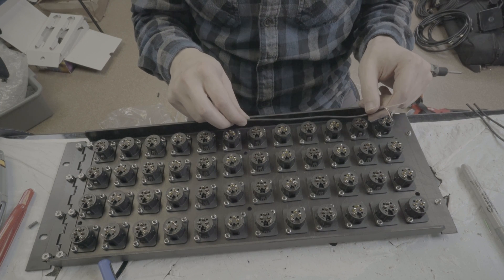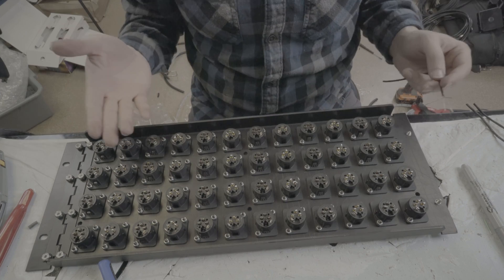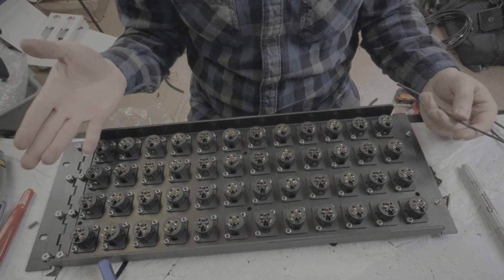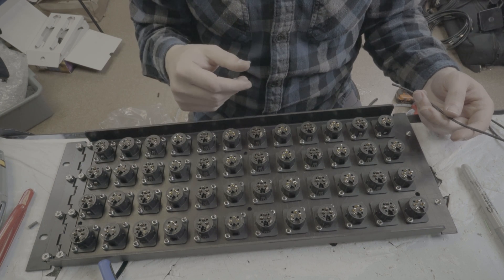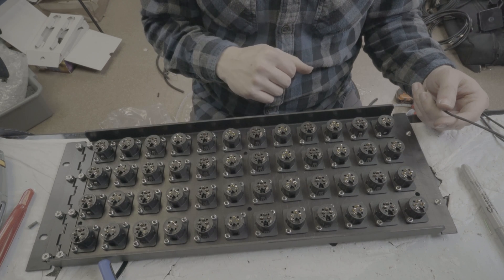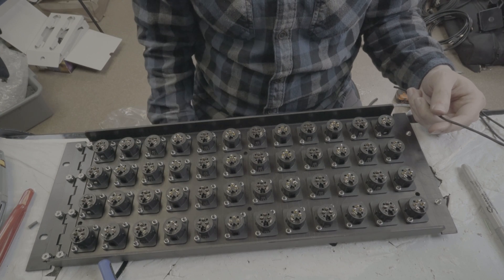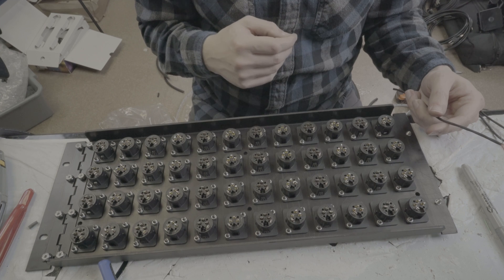There are lacing bars that go across here, so all of this cabling will actually get tied down. When you're doing a split panel for in-ears, you don't actually need a transformer — you're essentially just building a very pretty Y cable. If you want to get more advanced, you can add a little switch on each one that will lift the ground; you wire the switch in line to pin one, and then you can click the switch to break the circuit on pin one to get ground loops out of the equation.